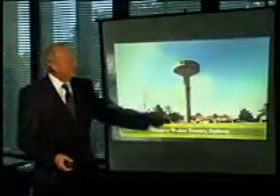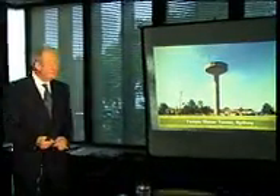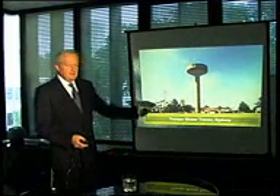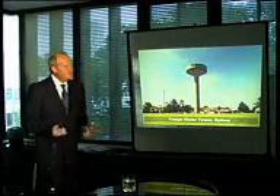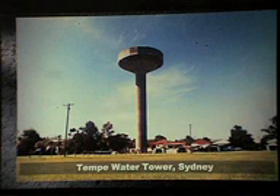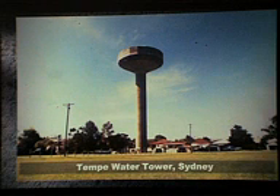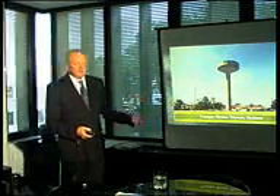This is a typical potable water tank, actually quite close to Sydney's International Airport when you drive past at Tempe. The job requirement for Radcon here was to remove a failed rubber membrane of about 30 years old vintage. You may be able to see some of the calcium leaching here — the tank was beginning to leak. The Radcon mission was to empty out the tank, dry it with heater units, and apply the product as a waterproofing membrane for Sydney drinking water.